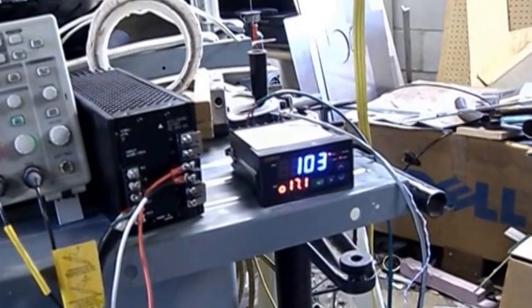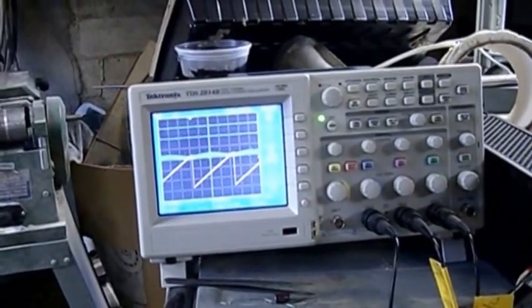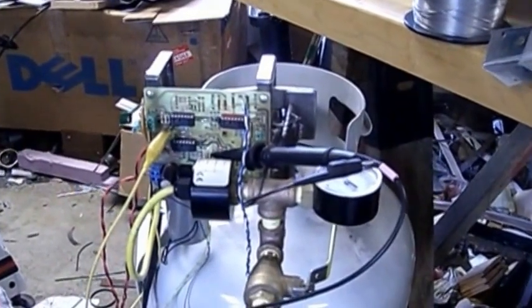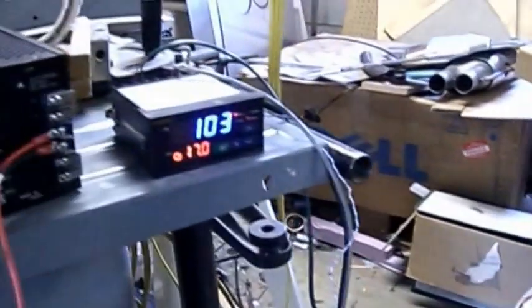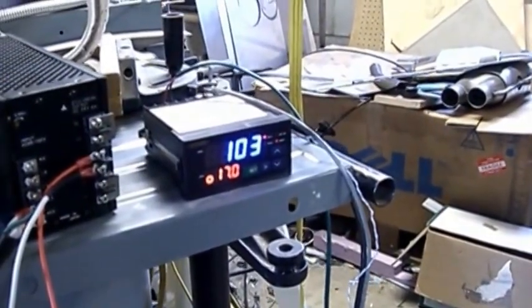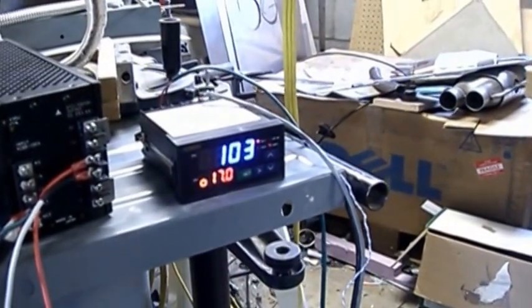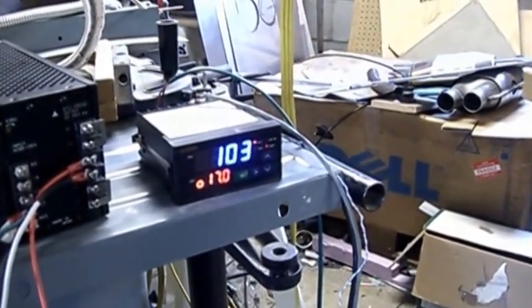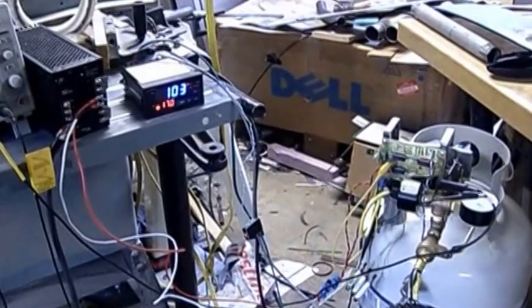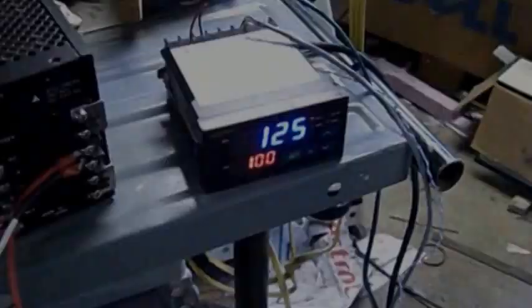Let's take a look at the controller - it's at 103°C. There are some waveforms that show the gas controller in action. That's going to be proportional flow driven by the temperature controller. Right now we're at 17 percent - 10 percent is actually zero - so we're about seven percent of the possible amount of flow we can do here. We're going to give this thing a start and I'll come back later and show it in action.